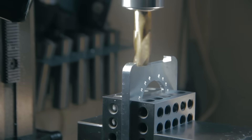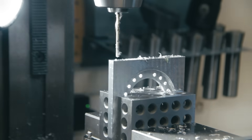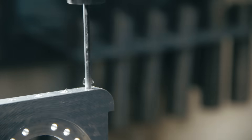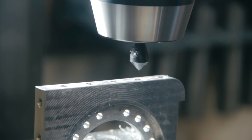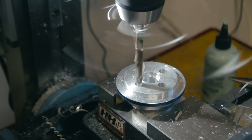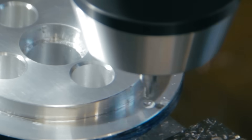It pays to really take a moment to consider how you're going to access each feature. Have you left enough room on the stock for the chuck to grip? Can you measure or test fit a part without changing the setup? Is it possible to machine the part all in one setup to reduce errors? If you mentally machine the part in your head before you start making chips, you'll have a much better chance of getting it right on the first attempt. But for now we're done with the lathe, and it's back to those CNC parts — they involve a bunch of manual labor in the form of dozens of drilled and tapped holes. We find the center line, start the hole with the center drill, follow with the tap drill, and finally the tap itself. A chamfer is the cherry on top.